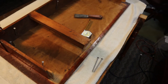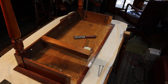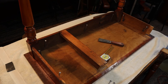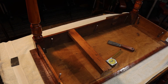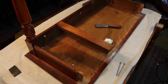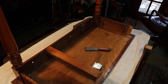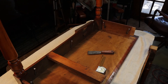One more thing while we're talking about this: in the beginning, the table was sitting upright on the green dots which located where the legs should sit in reference to the tabletop against the wall. This is important because if this table is placed in a room parallel to hardwood floors, and one leg sticks out past the other, they're not going to sit on the same board — it's going to look ridiculous. So I have to be aware of not only how the rails are attached to the top, but where the legs fall on the floor. They need to be equidistant and more or less a perfect rectangle. A lot to think about.